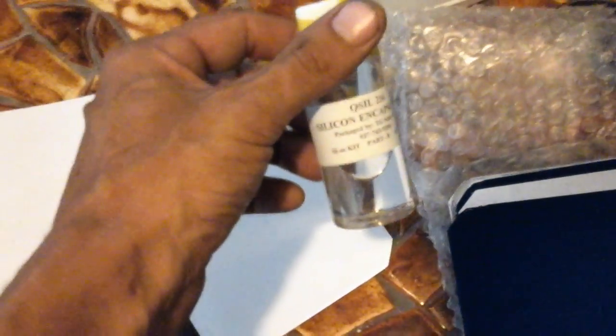Another thing that I've been doing — I've been building my own solar panels. I'm using monocrystalline SunPower solar cells. These are very nice; they resist the cracking and the heat that normal solar cells have issues with. I'm using a quick silicone encapsulant — it's a 2-part process. I'll make a video of this later on of me building the panel. I already have one up.